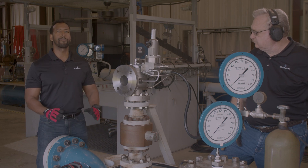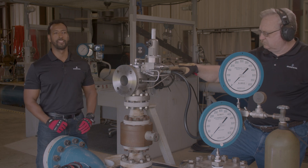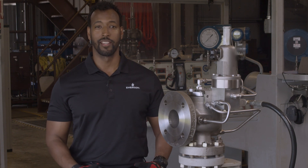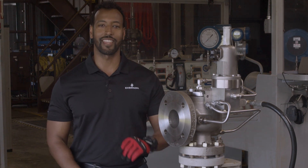For additional safety, this field test connection is built such that it will always pass the highest pressure through the pilot. If the system pressure under the valve increases at any point during the procedure, the field test connection will shuttle back to pass the higher pressure to the pilot. This ensures that the pressure relief valve will operate normally and provide overpressure protection. For a demonstration of this, check out our Anderson Greenwood 200 series field test connection video — there is a link in the description below.